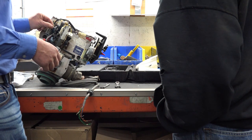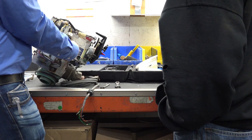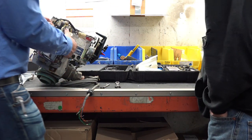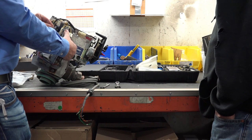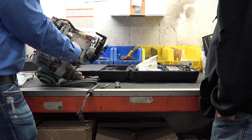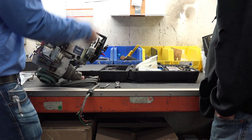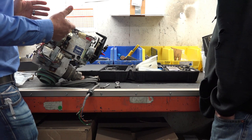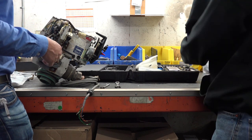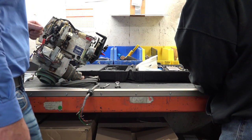That's how you disengage the motor, and then you can manually turn the key. So like a lot of times, hooking up this piston is problematic. Utilizing this to disengage it, you can line it up real easily because you can manually turn it. When it's engaged, you can't turn it. And like the new one, it's always engaged. They don't have this old style motor anymore. But these motors, you can disengage them, and it makes life for service a lot easier.